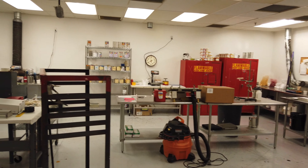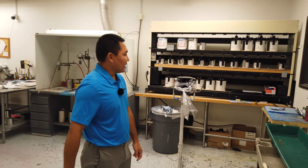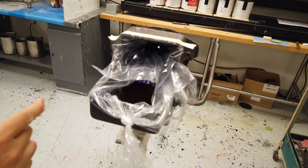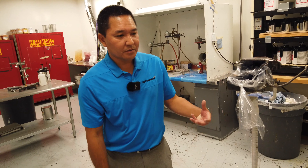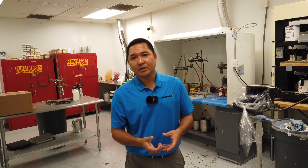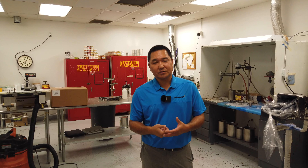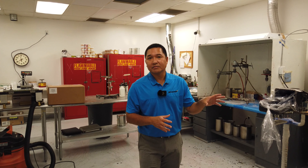We have all these different types of paints to get the color we're after. This right here is what we call a squeegee method — the paint is in there right now, this is actually a purple paint. The technician will put the golf shaft in there and pull it, and it gives it the color we're going after. Certain colors are tougher than others because the tube is actually black, so for a yellow shaft, you can't just put yellow on there — you have to put white on first and then the yellow. So there are different color combinations that the technician figures out to achieve the final look in the marketplace.